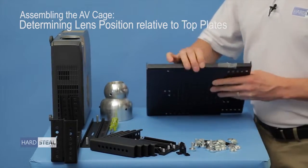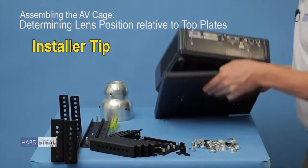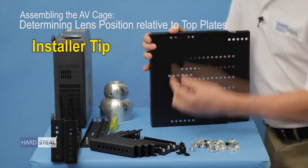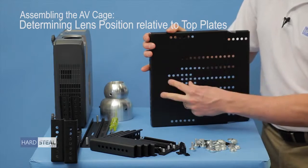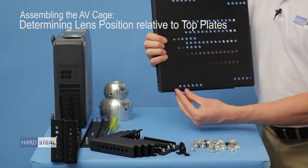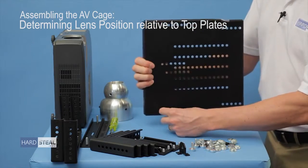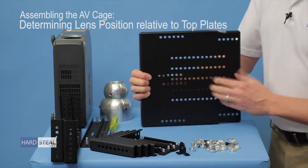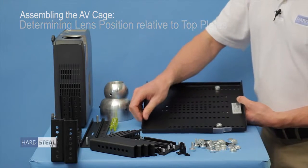The reason why I've chosen this side as the lens side, as opposed to rotating it, is the position that the lock tab is going to be — my lock tab bolts into one of these six positions. I want to have my lens on the opposite side because my wings and the wing assembly is going to wrap around the projector approximately here. So I want to have my light path opposite the side where the wings are when the arms run perpendicular to the light path.